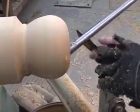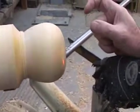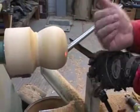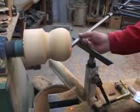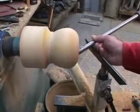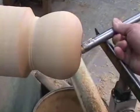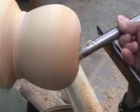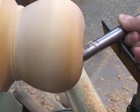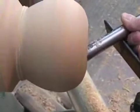Now, when I make those measurements, I'm going in and stopping and stopping. There's just naturally going to be little tiny tool marks in there left over from my measuring process. So now I'm going to take a deep breath and stand comfortably here just with my fingertips and go back and forth and clean up the tool marks. Hear the little hiss? That little hiss is what I'm after. The laser's gone, I can't see the laser anymore, so I want to just clean up the tool marks. Hear that little hiss where there's a high spot there?